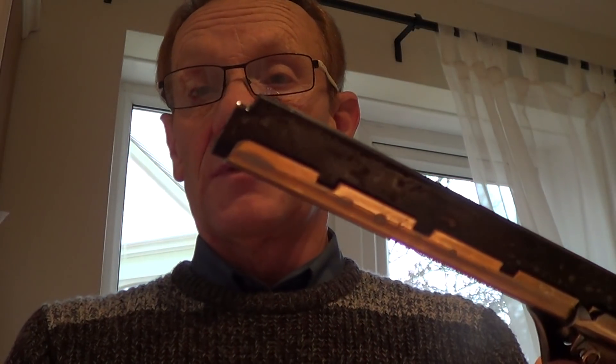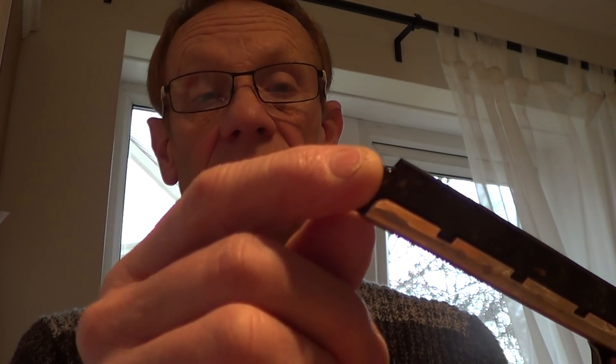The technique will take a while to get used to, but it tends to work until you come perhaps to the old frames — wooden frames — whereas that stop will stop against the wooden frame, and you'll leave the amount you've cut down the side of the frame, unfortunately. But for 90% of the time, modern frames have got rubber seals anyway, so this will work most of the time if you just want to try it. So there you go — there's notching in the dog earring. Job done.